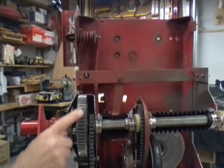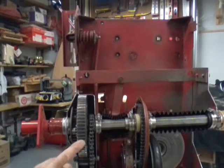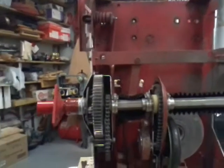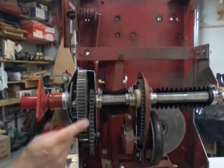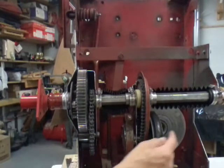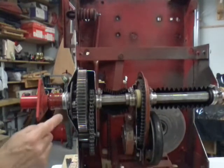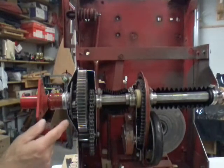Another thing that could be stripped out is this large gear — they call this a 63-tooth gear — or the small gear on the bottom. There's a small gear down here that meshes into this big one. This is all part of the gear reduction to get from your 3,000 RPMs off your motor down to about 12 miles an hour ground speed in fifth gear.